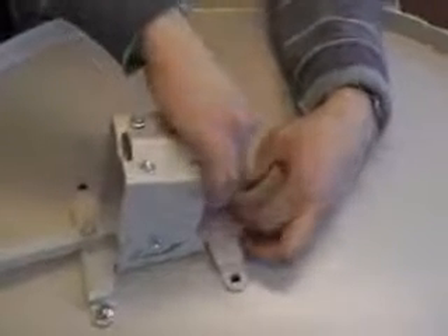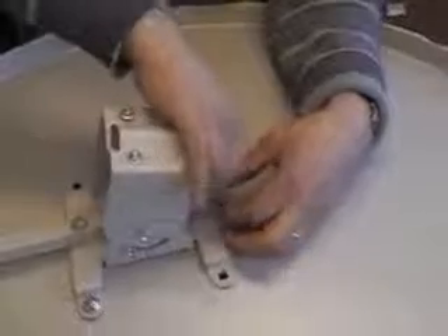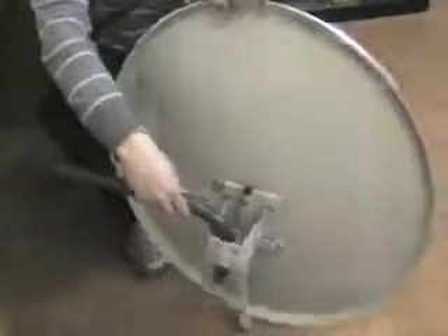I'll just get this nut and bolt and slot it straight through. That's more or less beginning to end the assembly of the dish. The next step is a plastic insert here, simply to stop water from gathering in the feed arm at the back — just push this down until it's secure. We'll use a 10mm nut to mount this bracket onto the wall. The bracket sits on the wall and the arm feeds out like this. It's ideal to feed it this way because, if you hold it to the back, it allows a full 180 degrees rotation so you can swing it from side to side.